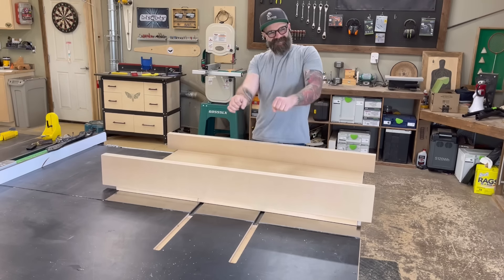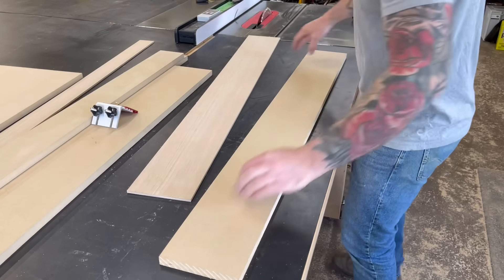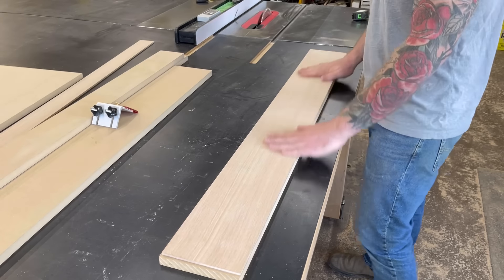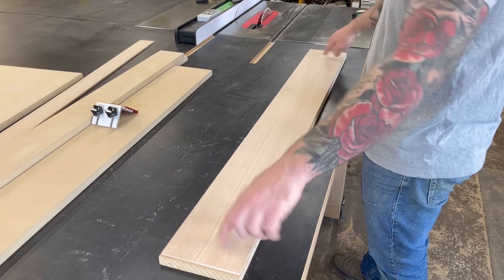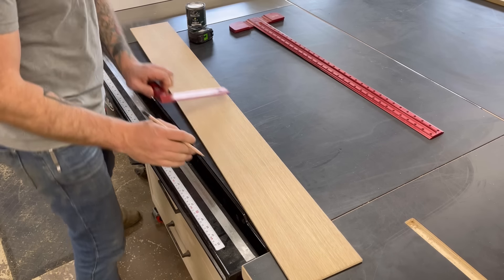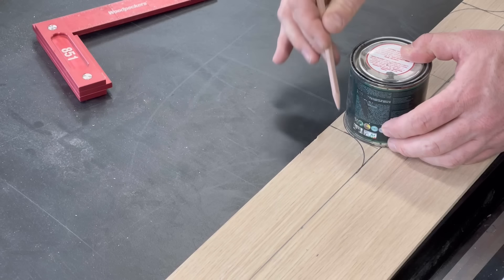So here I've got my front fence, my back fence, and my o-fence — that's what I call it when I dance, because when I dance, it's offensive. For the back fence, it's got to be a unique shape. If you've ever seen a crosscut sled before, you know that the back fence raises up in the middle. That's because when you build a crosscut sled you essentially cut it in half, and because you want those two halves to stay connected, the back fence needs to have this raised-up part so that everything can be held together and still be strong.